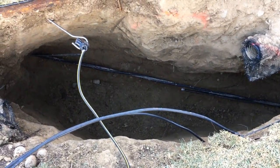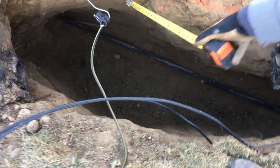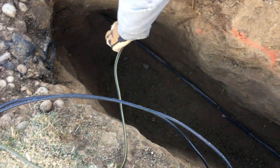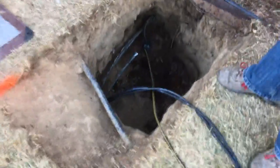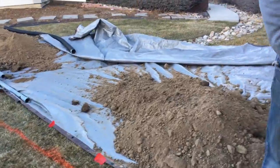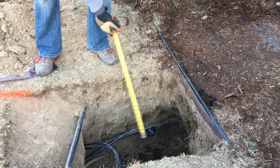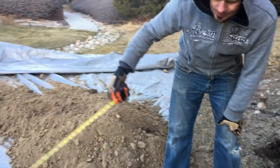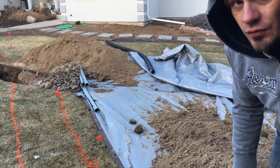We got some three-inch pipe to fix this preliminary drain. What I did is I took the neutral going to the house and bypassed right here, because I wanted to see if the house was bad. I hooked up from there to the meter — it was good. I hooked up from the meter coming here to the house to jump this 25 feet — it was good. Then when I hooked up this line here to here and connected it, between here and here is bad on the neutral. The ungrounded hot conductors at 240 are fine, but the neutral is bad.